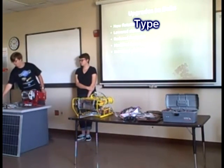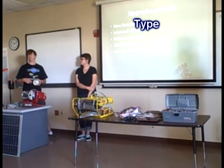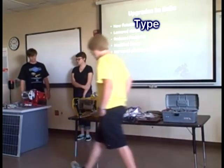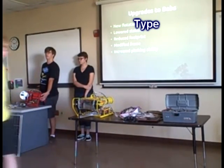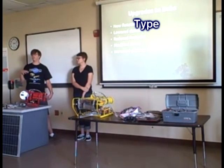So we went about that by creating this syntactic foam. This is basically a composite made of small glass microbubbles, which are microscopic glass bubbles that 3M makes, held together with fiberglass resin. So it's extremely lightweight, but still has enough volume to provide buoyancy. When we made a block of this that sits in the middle of the robot, that allowed us to move the thrusters inward,